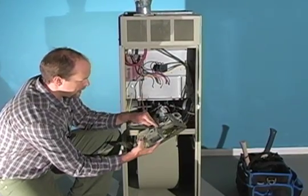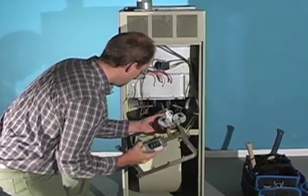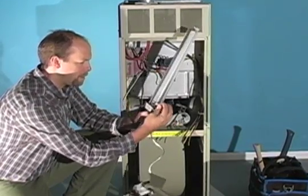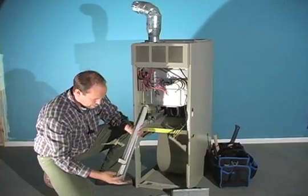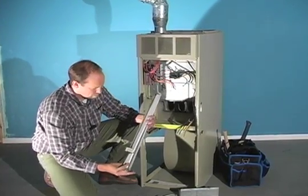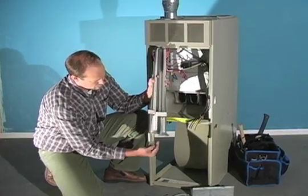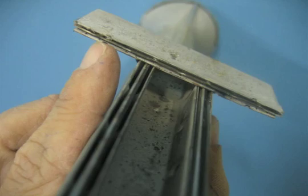Here's gas supplied from the main valve to the pilot light right there, and it's on the middle burner. So there's the intermittent pilot light sensor. Let's just keep pulling these components out. The burners simply slide right out, and here's where the crossover is — the bridge. So the flames shoot in, ignite, and then the flames cross over from one burner to the next.